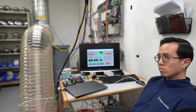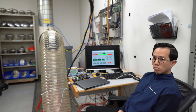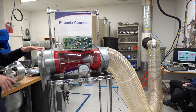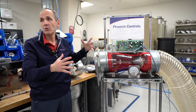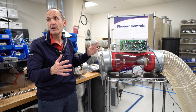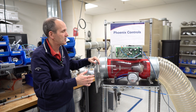It's a good time to mention that we do sound testing for all the product. Everything has NC and RC ratings on it, and you can pull up the catalog for every flow and every pressure to see what the sound is going to be. The design of the valve optimizes and minimizes noise, especially at high frequencies. But in case there are high frequencies you want to eliminate, we offer a neutralizer product which enables you to decrease the sound even further — in some applications, it might be beneficial.